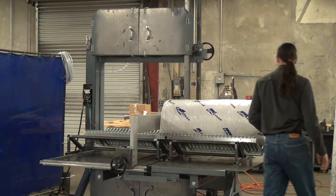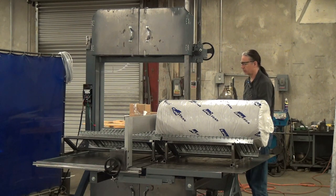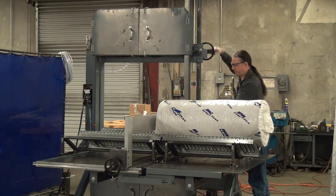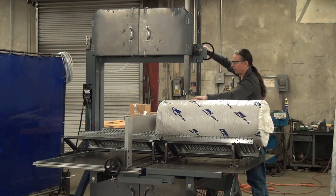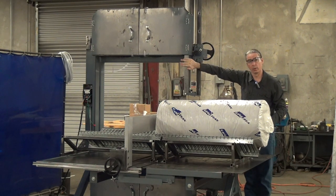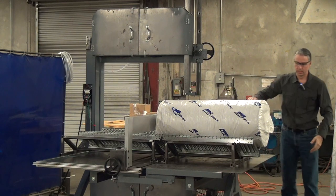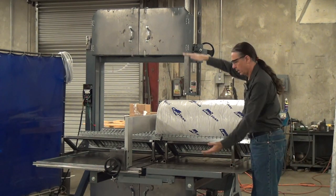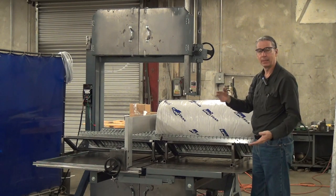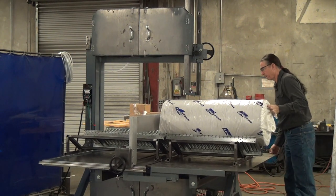This machine has an adjustable upper guide, configured with all roller blade guides on an adjustable position. The idea is you raise the position of the upper guide until it just clears the work piece. It does two things for you: it keeps the unused portion of the blade guarded, so if you accidentally touch it you're touching guard not blade, and it reduces the free blade length. There's also a blade guide under the table. By lowering the upper blade guide until it's just above the work piece, we have shortened the free blade length, which helps stabilize the blade — again making sure you get a straight cut.